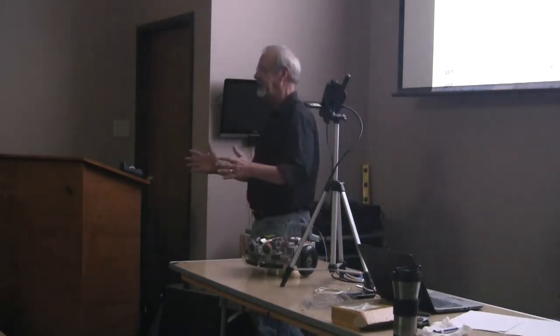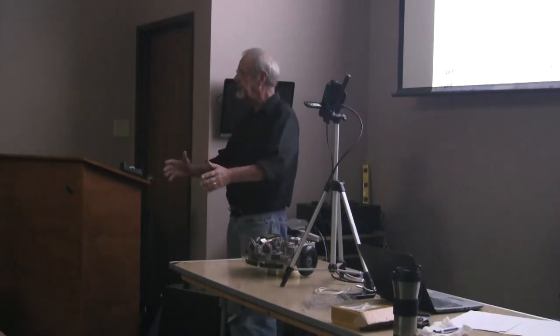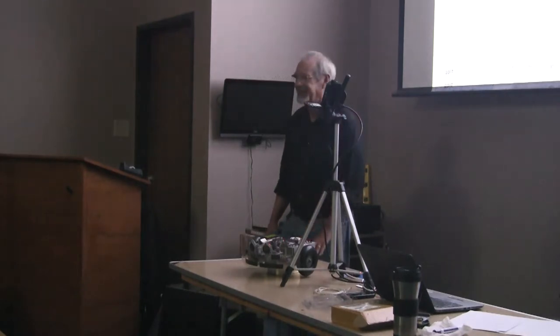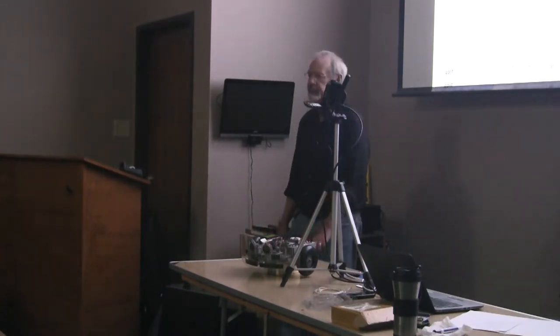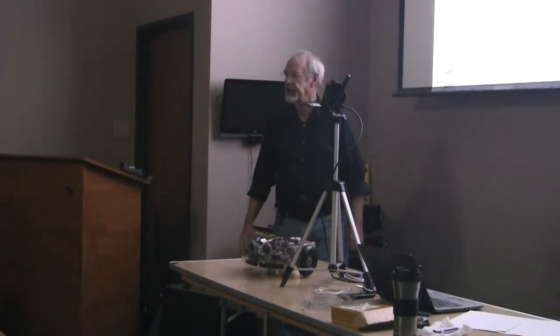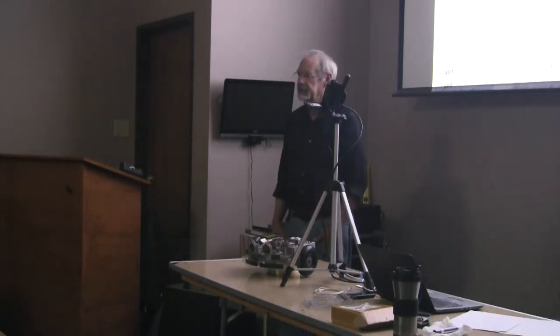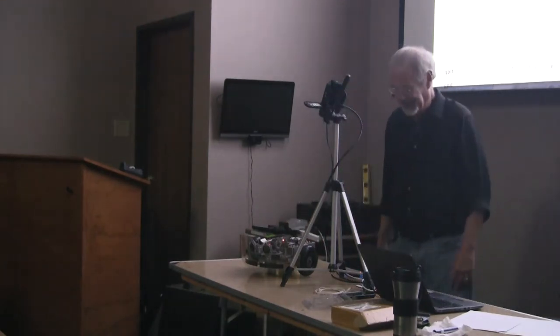So do you want your robot to be really robotic? Or do you want it to be more graceful? It's also power, too. The more latency you're using, the more power. Yes, that's totally adjusting the cost. Is it PI or PD? PD. You use derivative. Derivative is damping. That's one of those constants you had up earlier that you loaded in for each of those little pieces.